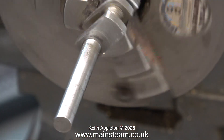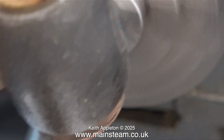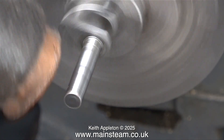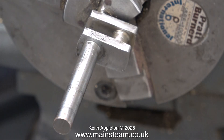Eventually during the build it was time to straighten the crankshaft. Here it is in the chuck in the Myford, and yes — I am using a hammer. I've done a lot of this and I can straighten crankshafts using a soft hammer like this. What you have to remember is: once you tap it and it suddenly becomes perfectly true, don't tap it again. This tapping is infectious — once you start it's very difficult to stop, and it's really easy to make it straight and then bend it again. The size of the crankshaft depends on how hard you have to hit it. This is not a good way to do it, and it's really not a good idea to hit the crankshaft whilst it's still mounted in the engine — although I admit I have done this in the past with limited success.